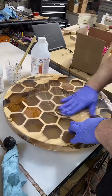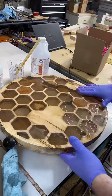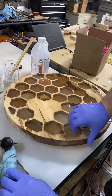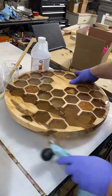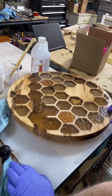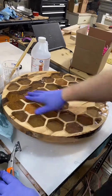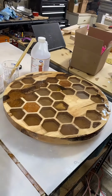After I do the first one, I sand it and then do the second one and sand it again, and I only used like 80 grit sandpaper, so something really rough. But that doesn't shed. You definitely don't want sandpaper leaving little particles all over your tabletop. I also wipe off all the dust with a lint-free rag and then clean it with denatured alcohol between. And in the end, it should have a crystal clear, shiny finish, because it's good to be weird with wood.